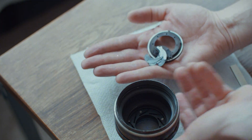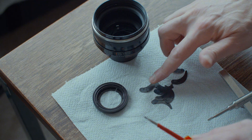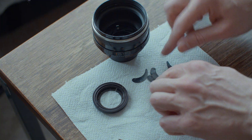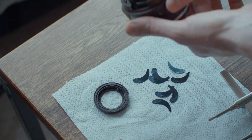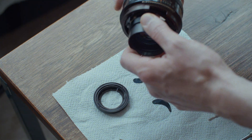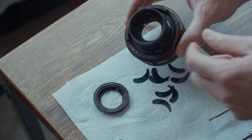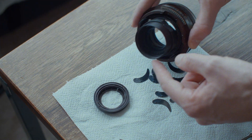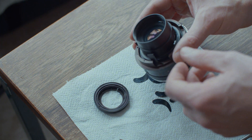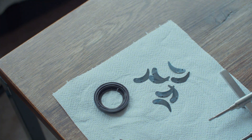There's the aperture mechanism - just need to clean the blades and then reassemble. That's pretty much complete disassembly. I think this is one of the first generation of this 120 millimeter size. There's another element in there but I might leave that in since I'm struggling to get it out, but anyway - that is complete disassembly.